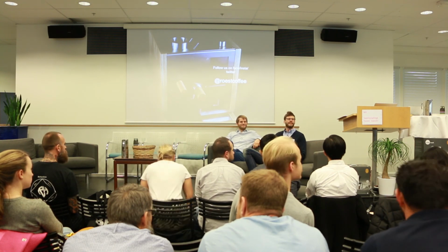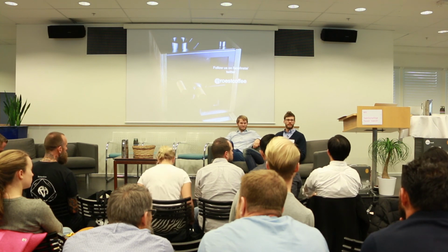Which data are you saving right now for fully automatic roasts? We're logging all the sensors: the bean temperature, environmental temperature, the gas value, the fan value, the time, and every event like first crack, also the speed of the roast. The cool down process of the coffee beans will be logged too, so it tells you how long your cool down period was. Bear in mind the cool down is in a separate container, so you can back-to-back roast. You don't have to cool the coffee beans in the roasting chamber.